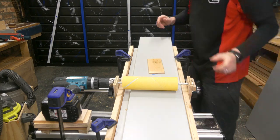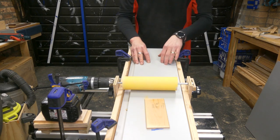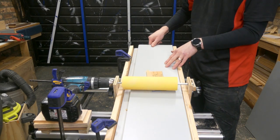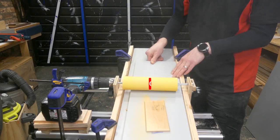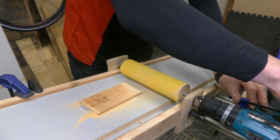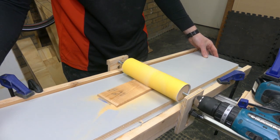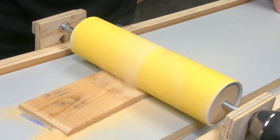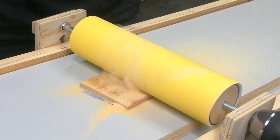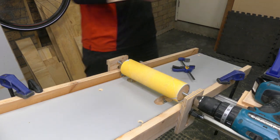I've used the super glue trick to attach that thin piece of pine bed slat — an off-cut from my sandpaper testing — for the inaugural run. It wasn't high enough at first; it was only just touching, and I could even feed it through backwards which wasn't terribly clever. After adjusting the height on one end, we had success — I was getting a nice steady stream of sawdust coming off. A tiny clamp allowed me to control speed. Running the test piece through, I found that getting the parallelness of the drum was tricky due to its slightly crappy nature, and it also had quite a bit of snipe. But I sort of accepted that was going to be part of it, because it was kind of loose in those bushings — the bolts don't fit perfectly. It was actually advantageous to have the workpiece, as it feeds in, effectively stabilize the drum, so there's heavy snipe right on the leading edge, but then that upward pressure allows for a more even run over the surface of the workpiece.